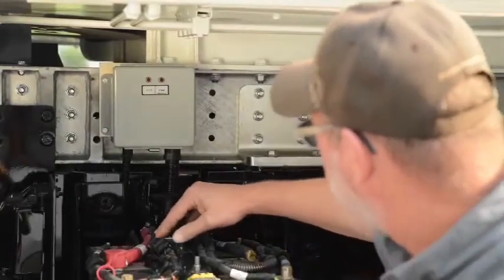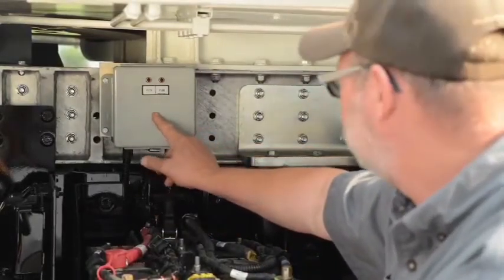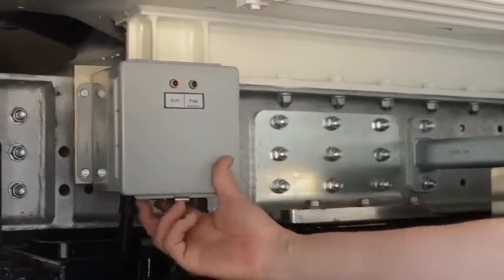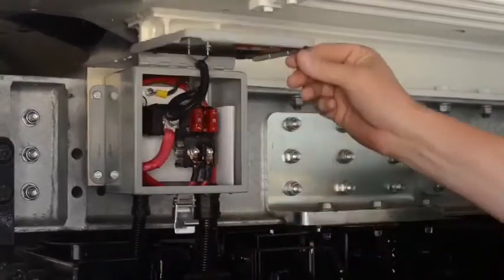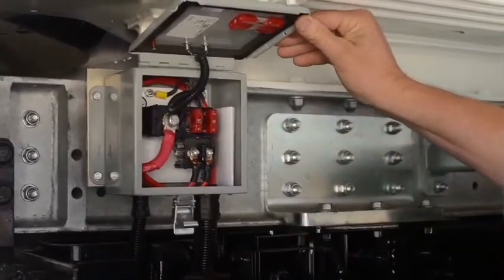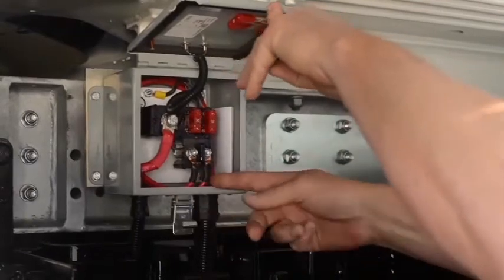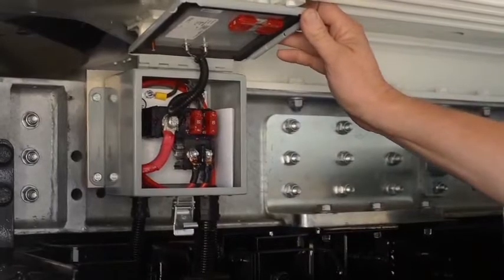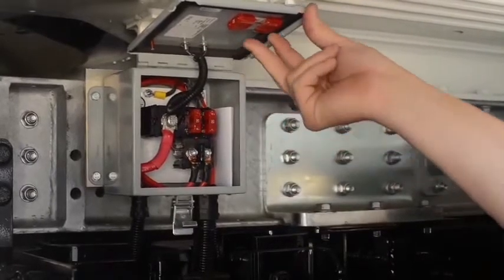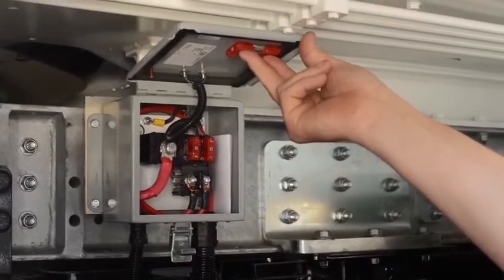Power from the batteries goes to the main fuse panel for the Putzmeister pumping system. Underneath this box are two 50-amp primary power fuses. Undo the latch and just visually look — are these cables tight? We also have two 50-amp fuses here that provide power to our converters. There are also two spare fuses taped to the top of the box for you to use.